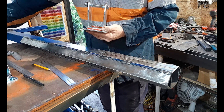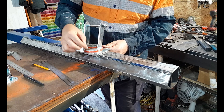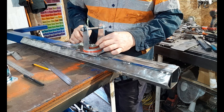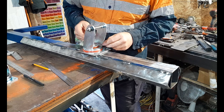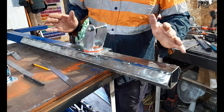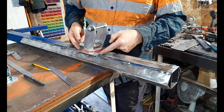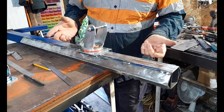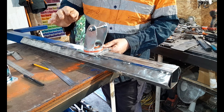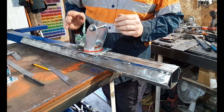This is going to be welded straight on to the mid frame. I contemplated putting it on a plate so it can be taken off, but this is a 300 kilogram rated caster with a grease nipple, really large bearings, super thick materials, and a heavy duty top cup where the stud is actually a bolt with a nut. I'm very confident it won't fail, and if it does I can take my mid frame apart. If needed I can cut it off with an angle grinder in about 30 seconds. Putting it on a plate would make it another five millimeters higher, and my tolerances are already pretty close on my traction loss axle casters.